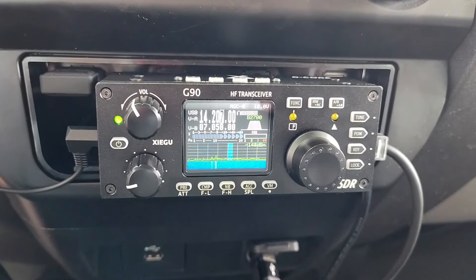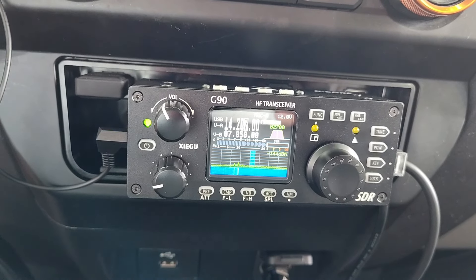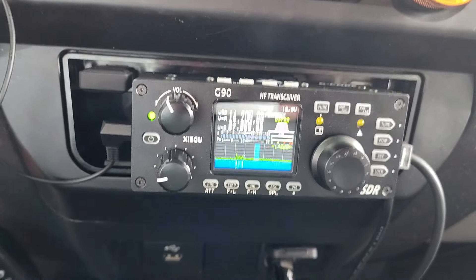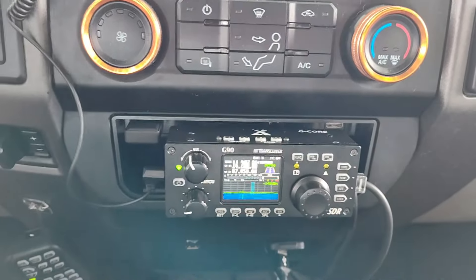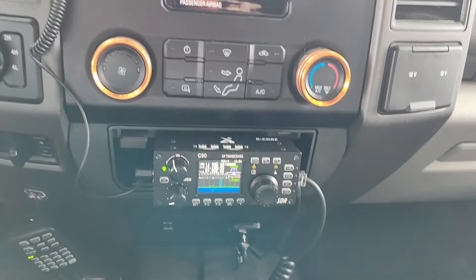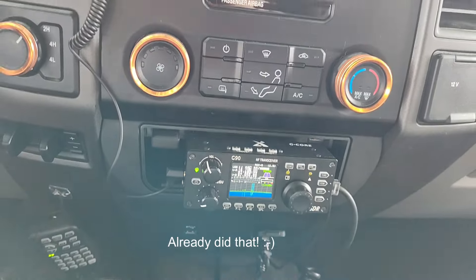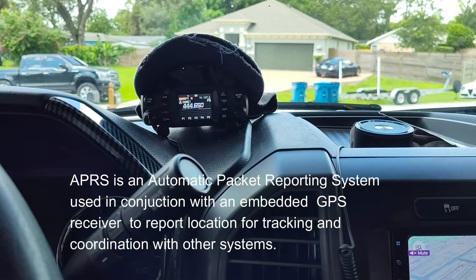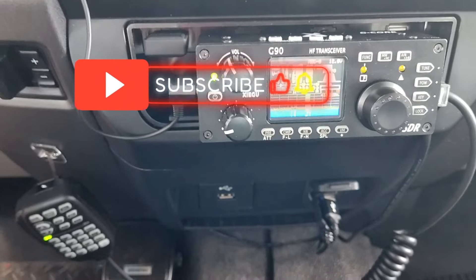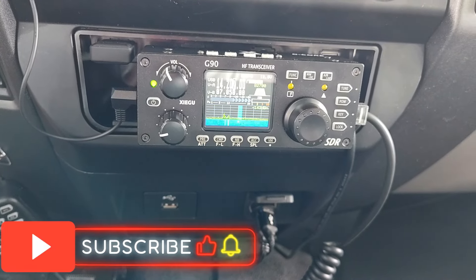This is the Xiegu G90 mount. I can also use 11 meters on the antenna if I need to — I use that when driving just to monitor CB channels, which is nice when traveling. I can also do POTA with this — just drive up and turn it on. So this is my Xiegu G90 with a Yaesu ATAS 120A antenna and MFJ 1925 controller. I'll include pictures of all the ground bonding. I also have the FTM-200 with APRS and C4FM capabilities in the truck. Anyway, nice 20-meter signal this morning — take care, please like and subscribe.